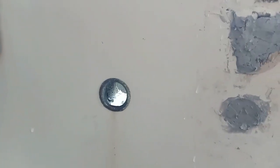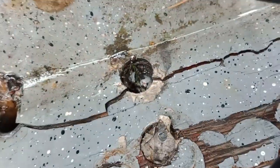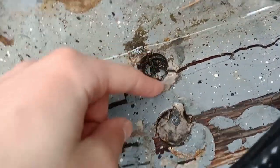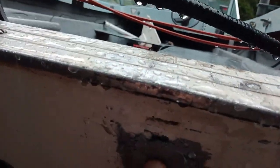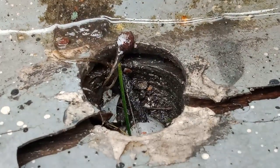But what are these? Well, for whatever reason, they decided that one drain wasn't enough, so they drilled two more holes and didn't put the metal insert in. They partially filled them back up with silicone — that's this gray stuff. Now there's open wood that's rotting in the transom.